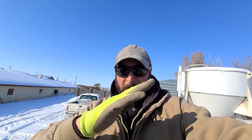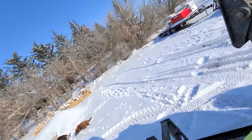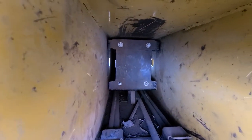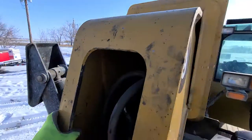Take all the shims out of the back for the bottom parts of the boom — just make it easier for yourself. That gives you more clearance to allow you to tweak the ram at a low angle to get the guide in the front to go over top of your bogey wheel. You really have to drop the ram down — we actually ended up breaking that piece off of this one, and it's not really necessary because this plate here gives it enough rigidity. We don't expect any problems from not having that one piece on there.